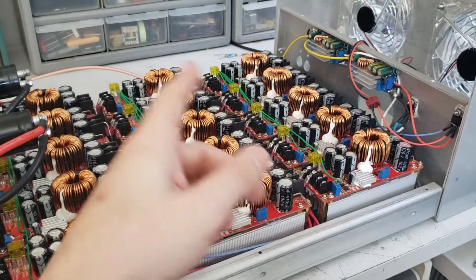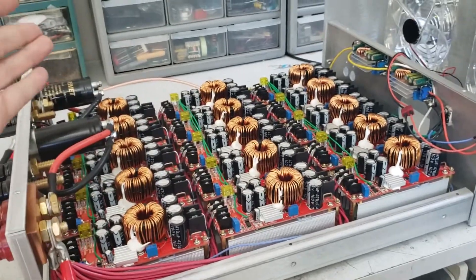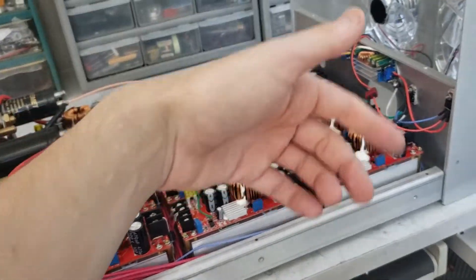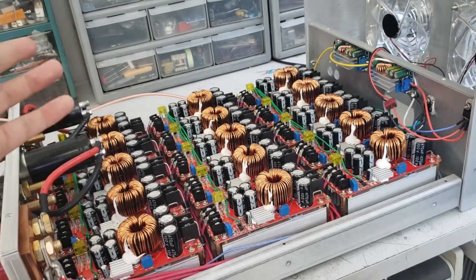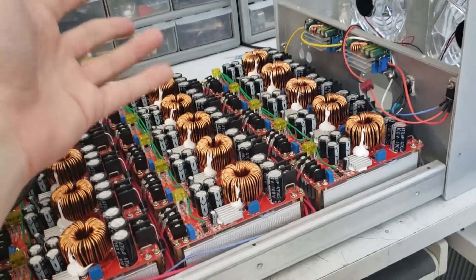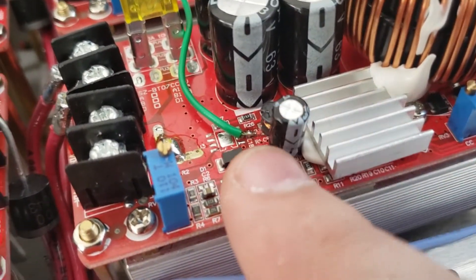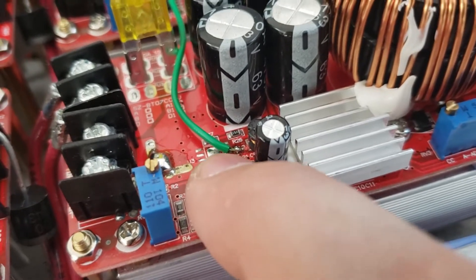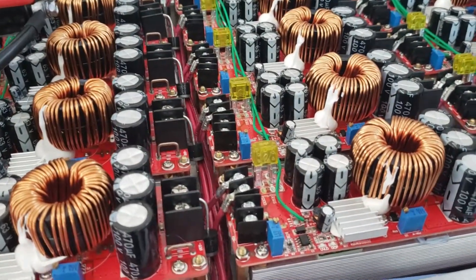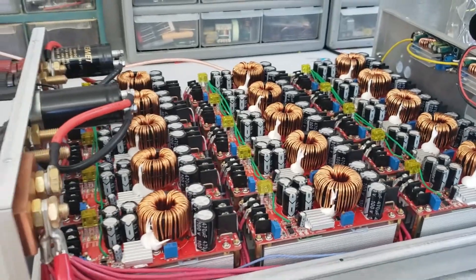Had I known that when I was ordering all this stuff I would have gone a different route, but I ordered them and made the best of it — I powered through because it's just for my project, not for sale. I didn't want to spend a bunch of money going around in circles trying all different modules and wasting money on a whole stack I'm not going to use. So I made do and I modified these things. Each one of these modules — it's a buck module — had a little tiny 8-pin integrated circuit. I had to pry each one of those off every board and supply power to the control circuitry externally. Let me give you a walkthrough of what's really going on here.